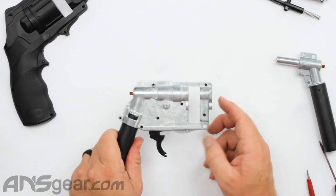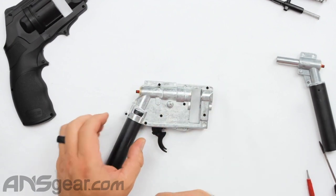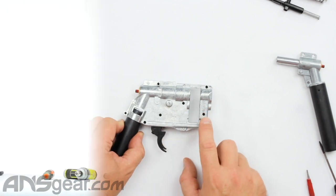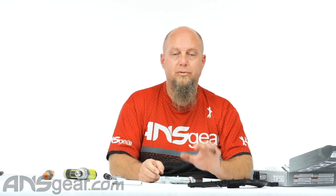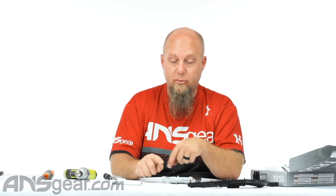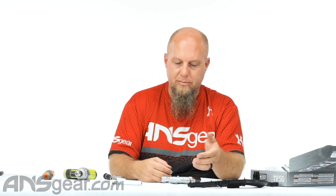So now we've got our meat and potatoes right here. We've got a couple more screws to take off. When we take these screws out, there are five linkage assemblies inside here, which all have springs on them. If we take these screws out and just yank this thing apart, those are going to go everywhere. They're tiny. You're not going to find them, and your gun will not work without them. So please be extremely careful when taking it apart or putting it back together. I'm going to point them all out so you can see them and show you how they fit in there, so if things pop out you can put them back in the right spot.